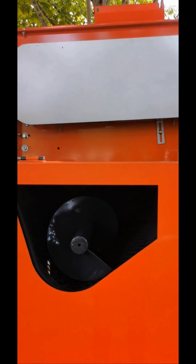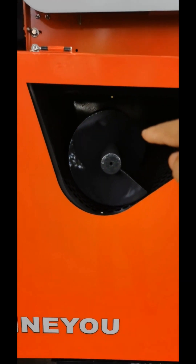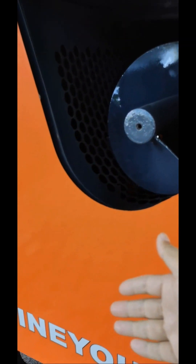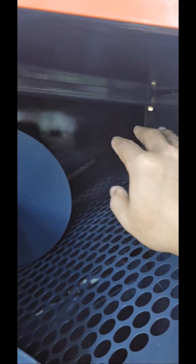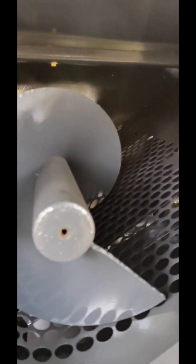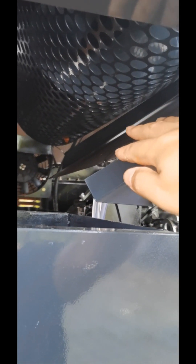The corn husk cover falls down through the husker peeling system and will drop out here — the rollers are running, so the corn cover comes out of the harvester. If there are any corn seeds broken by the peeling system, they will drop here and go inside the corn seed collecting system. After opening this panel, you can see that any corn seeds dropped from the peeling system are collected by the corn seed collecting system, and they will drop down into this box at the bottom.